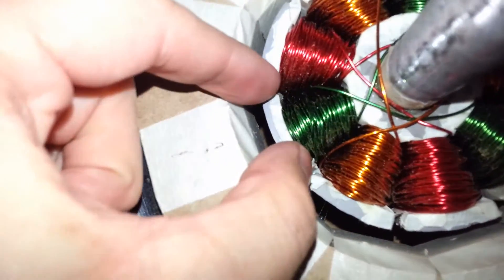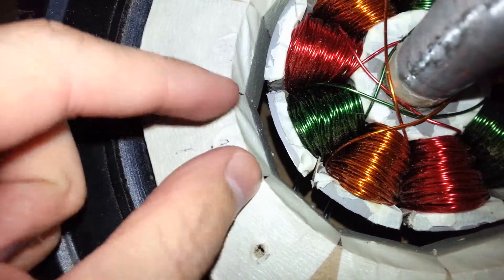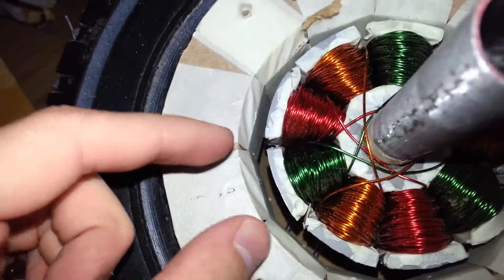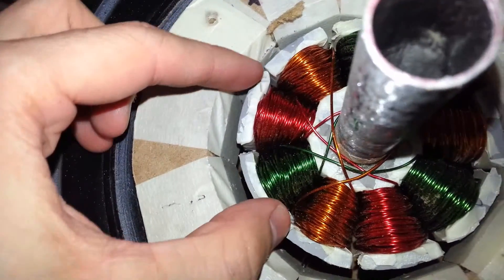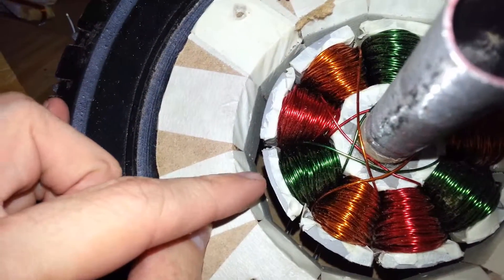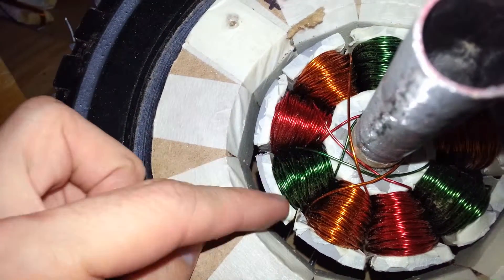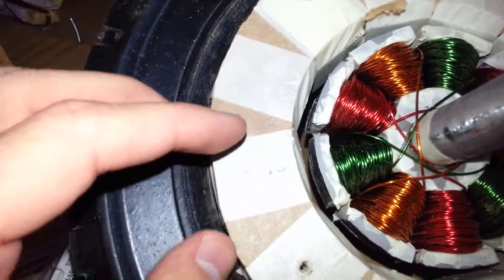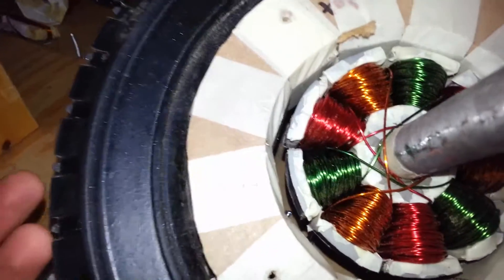When the steel is completely in front of the magnet, you're getting the most force passing through it, so it's attracting the most and tries to stay in that particular position. When it rotates and there's a gap in between, there's less magnetic force going through any one stator tooth — it's spread out. That alternation of forces creates what's called cogging torque.